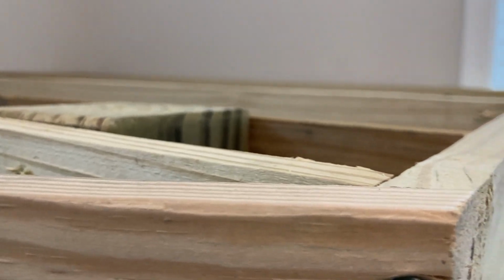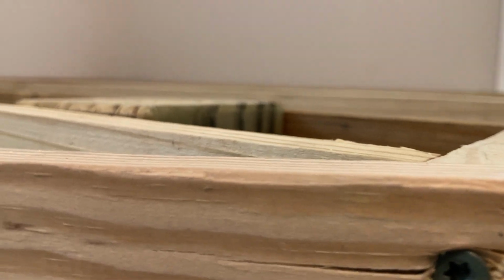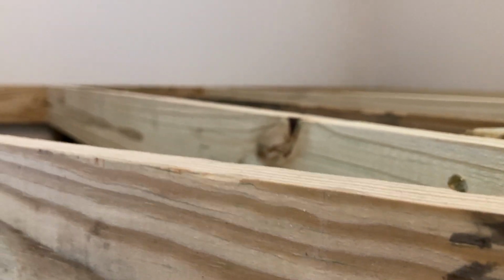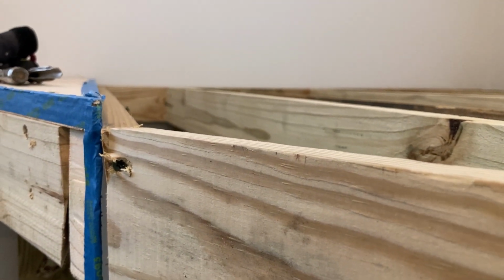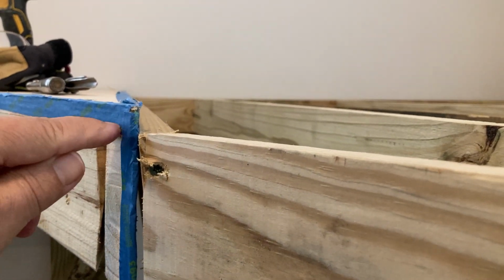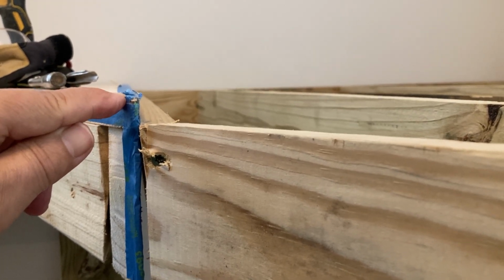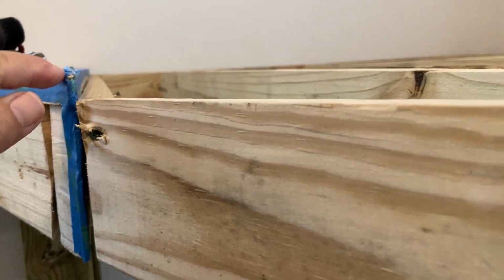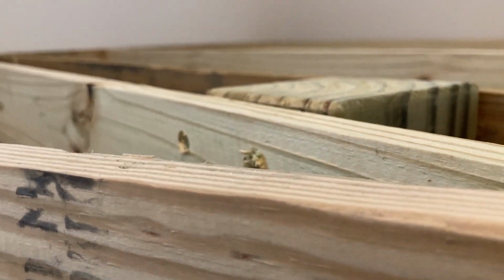If it's on the outside, I maybe could have just said, okay, that corner's going to be a little high, don't care. But since this section of benchwork attaches to this section, the tabletop won't lay flat over that little bump, so it rises up, ends up putting it too high on the adjoining table. So the only way to adjust that is to raise every other leg, or to take this one off and cut the top of it.